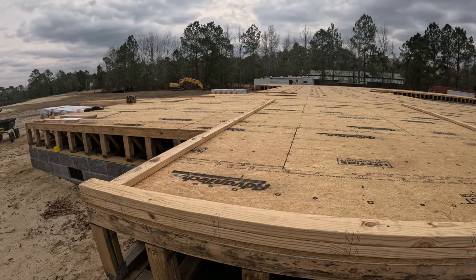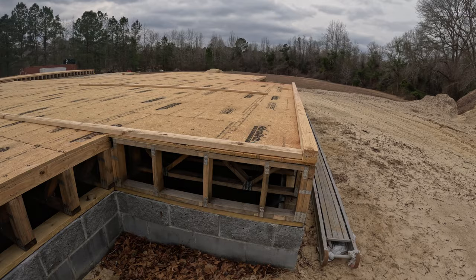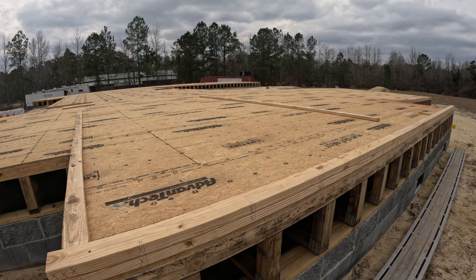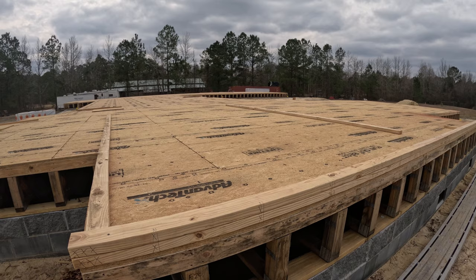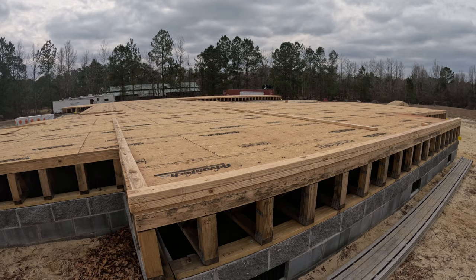And again, with this wall, you want to think about standing the walls up, because I build them laying down. As you'll see, I do it a little different than they do down here, at least. I build the walls laying down, I sheathe them, and I have wall jacks that lift the wall up into place. So you've got to think about that.